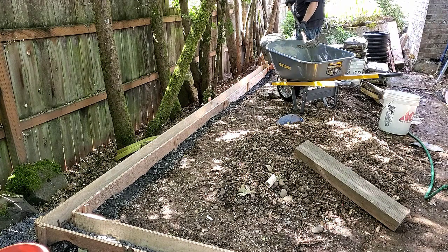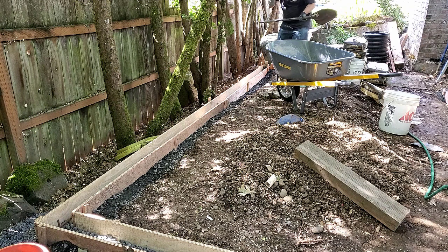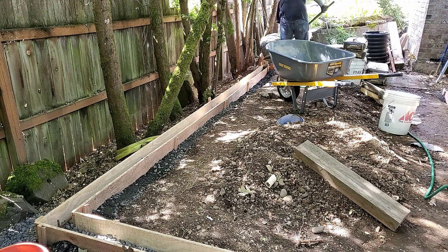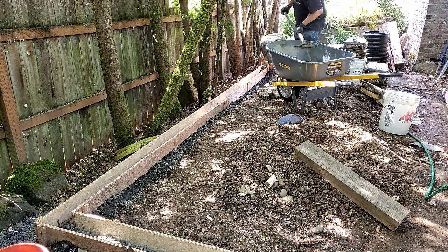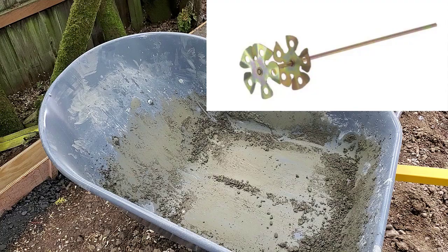So it looks like I need to add about 3 quarts of water in order to get this to be somewhat runny enough. It's supposed to be a little like Play-Doh, and this is definitely that way even with 3 quarts of water. I couldn't really get it mixed well enough with 2 quarts, so 3 quarts needed to be the case. How I mix it is I use a concrete mixer in a drill gun like this,